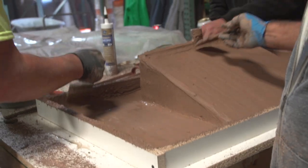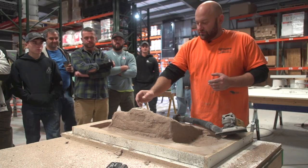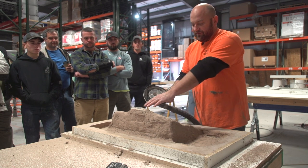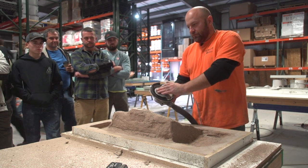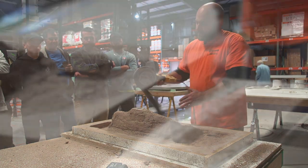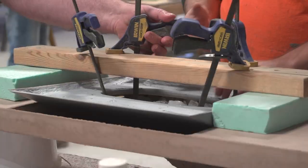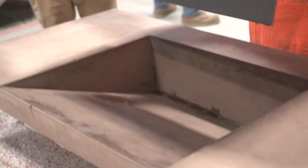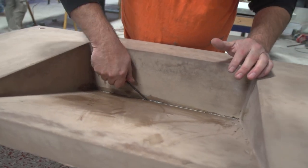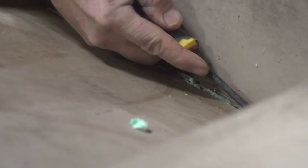We've got our slot drain sink poured. The other thing we want to do with something like this is put tape over it — that makes it a lot easier to be able to get it out. So what they've already done is took a hybrid blade. I recommend these for doing stuff like this because it doesn't throw as much of the aggregate, the sand and stuff — it doesn't chip as bad. If you have one of these hybrid ones, it hasn't filled in between. So they just took this and ground it down so it's flush. Now we're going to flip it over and pop the sink out. We're just going to take a screwdriver and pop this foam out of here, and then we can use some acetone or something to clean up the rest of it. The acetone will melt the styrofoam.